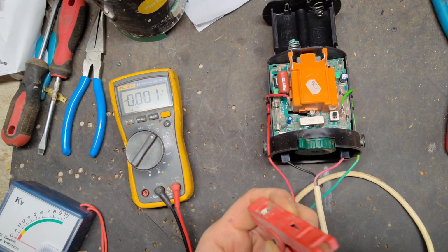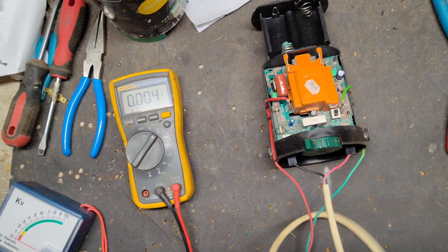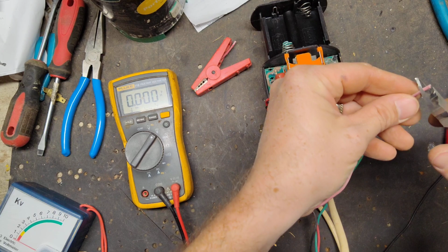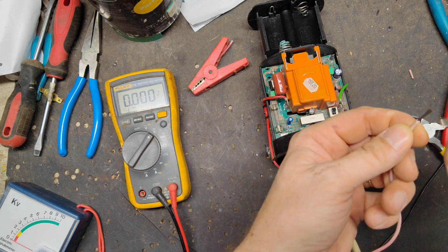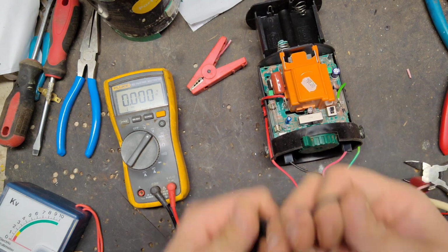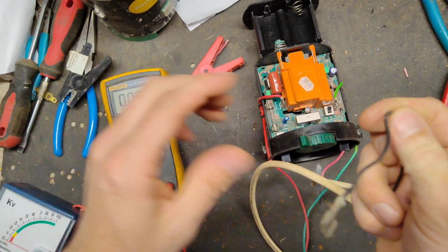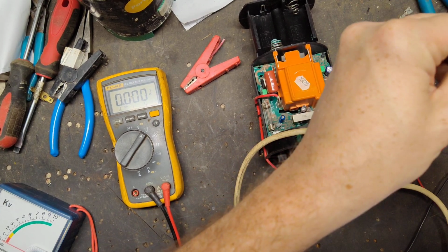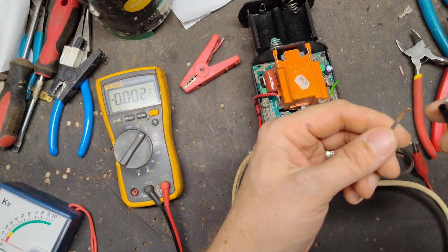The clamps are pretty crusty looking. Let's see if we just have some corrosion. Let's get this red wire. Okay, that red wire just broke. That's a problem, so we'll put the power supply lead back on there. This clamp's broken already, so we're going to have to get rid of it anyway, because it just flops around. We're going to pull that off. Yeah, a little crusty, but not too terrible. We'll go ahead and strip it back and put the black negative wire on here.